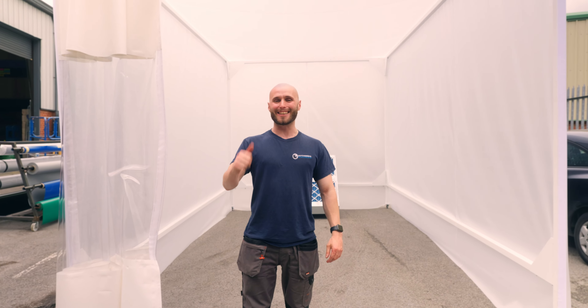With this extractor fan, we've worked with a specialist to calculate the air changes required to move the right volume of air in a space like this. When we get to site, we just need to cut a hole in the back of the spray booth to allow some ducting to fit through, and that ducting needs to go through the building and into the atmosphere — above the building eaves to align with HSE regulations. So here it is: my spray booth on wheels. Thank you very much for watching and I'll see you next time.